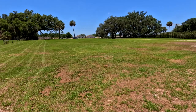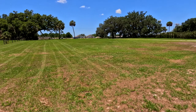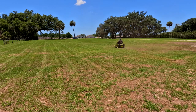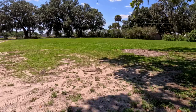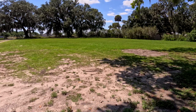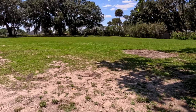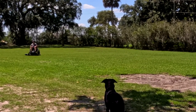In runtime testing starting at 100% charge, approximately two acres were cut before the battery dropped low enough to shut off the blades — though the mower could still be driven back for charging. This confirms that the blades consume the majority of the power. Lowering blade speed will conserve battery and extend overall runtime. During this test, both drive speed and blade speed were set to high.